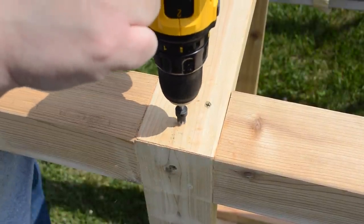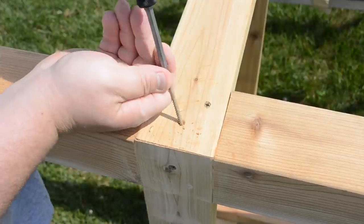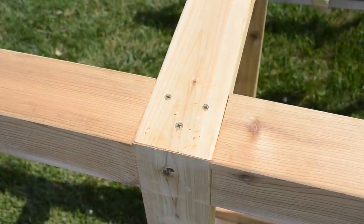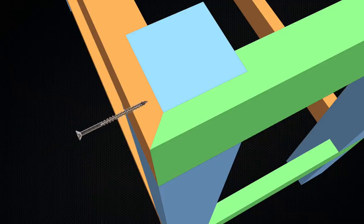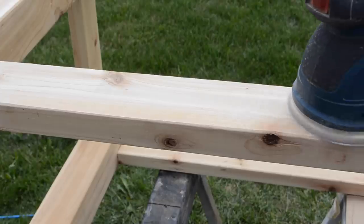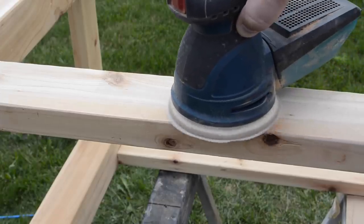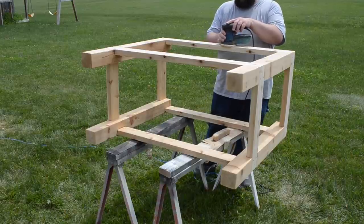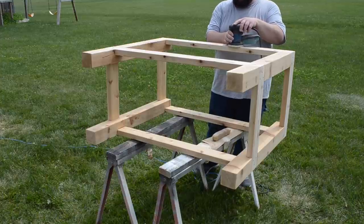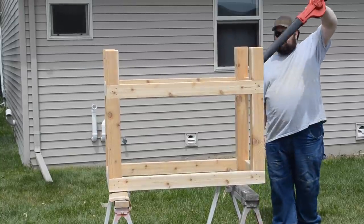As I mentioned, I had plans to use a different fastener in the corner — it didn't end up working out, maybe on a different project. I just added a third screw, making sure to go into the 4x4 and that the screw didn't go in between the 4x4 and the 2x4. Then it was on to sanding. This was dimensional cedar so it wasn't necessarily the smoothest, and for user ease I wanted to make sure there weren't any large chunks or splinters. I wasn't sanding to 220 — I think I went to 120. Then using a blower I blew everything off, and it was on to finish.